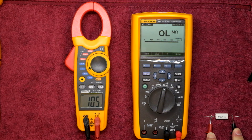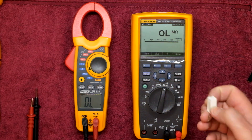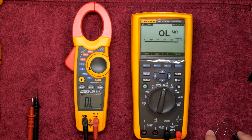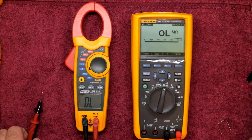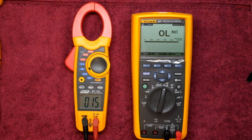The MajorTech is quite slow to read up — we get 10.3 to 10.4 ohms. Not bad for what it is, not as quick obviously, but we can live with that. For a 10K resistor, the Fluke reads 9.84 and the MajorTech reads 9.85 — well within spec. Not doing too bad.